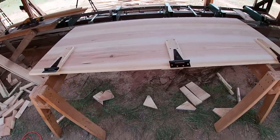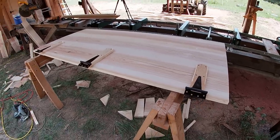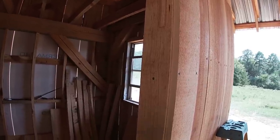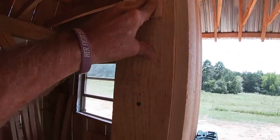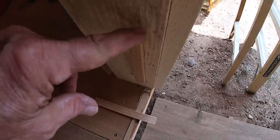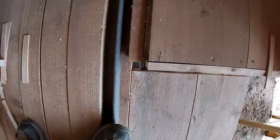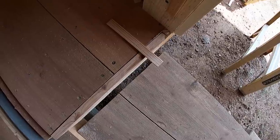I've got the door all put together. I went ahead and put the hinges on and the little pieces that the hinges actually sit on to keep the door back flush with the edge of the jamb. Now let's see what I can do about getting it up in the hole. If you ever run into a situation where you've got to put a door up and don't know exactly where the hinges will be — I've cut a little strip here, and from here to here is the thickness of the door. I set that back so it works as a temporary door stop, done the same thing at the bottom. I can let the door set against that and put wedges in on the edge of the door to get it where it needs to be. I've got another one where I can drive a wedge, and on the floor I've got a couple wedges for it to sit on — drive them in to raise it or pull them out to lower it.